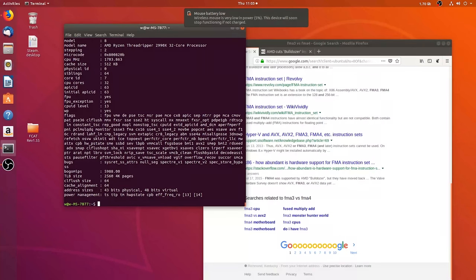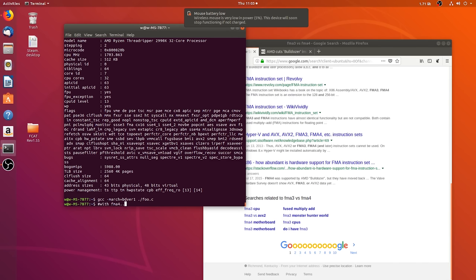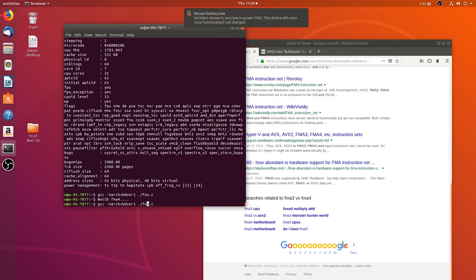Is it in fact still there? It actually is — it's just hidden. The Ryzen and Threadripper CPUs don't advertise support for FMA4. But if you happen to run an FMA4 instruction anyway, you will get a result — you don't get an exception like 'invalid instruction.' If you test the instruction set, it does work at least a little on the Zen Plus CPUs that I tried. I was trying to generate an error and I couldn't. But the people I asked about this report that the FMA instruction sets will actually produce errors in some scenarios.